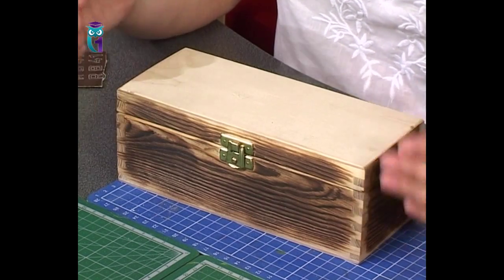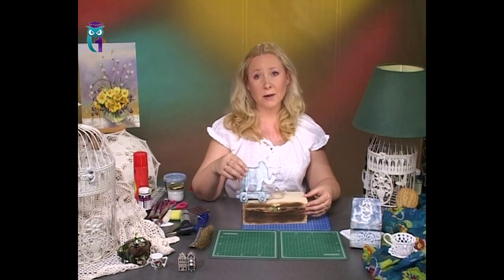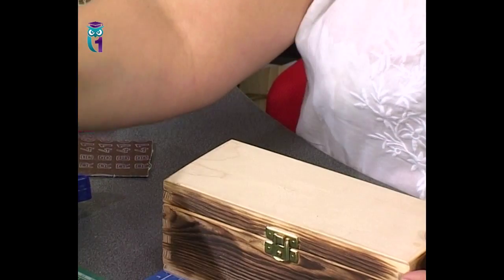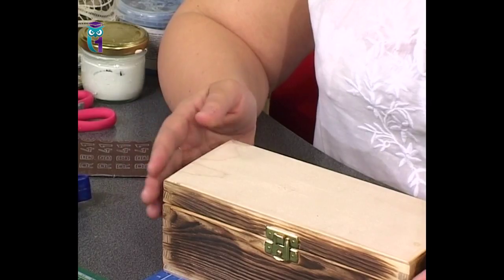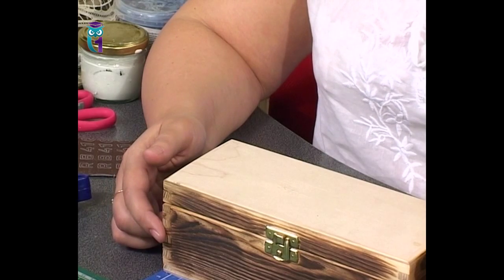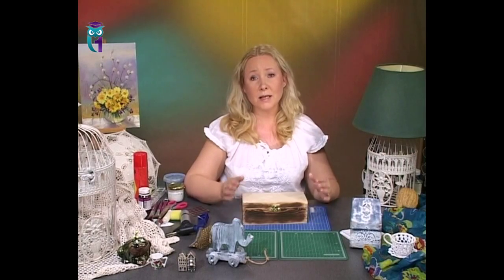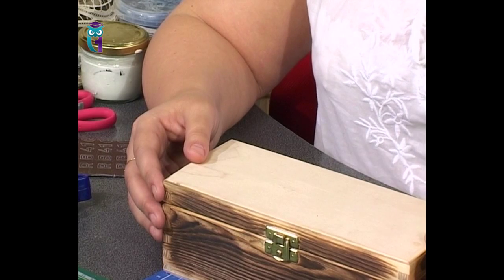If you roast a whole thing from a massive knot laminated, for example, a fine molded candlestick or such an elephant, there are no problems. Roast deeply as you want. But if this thing is glued together from separate details, as for example this casket, in no event strongly roast the places where details are fastened. The work will become unstuck and turn into junk. It's better not to roast these places at all. Later, they will equally get a relief in the brushing process by a brush.